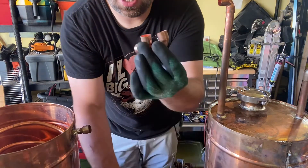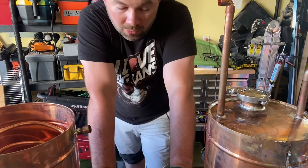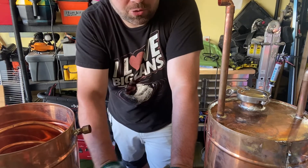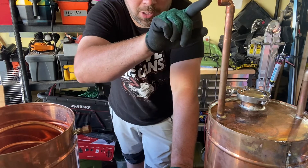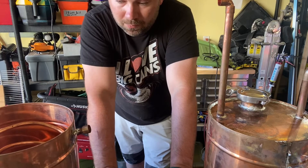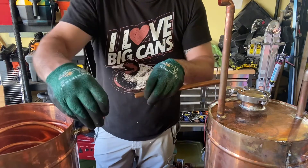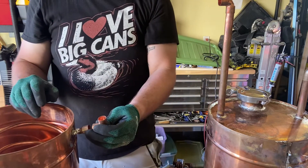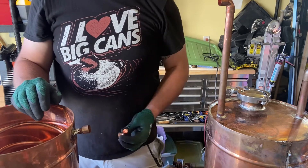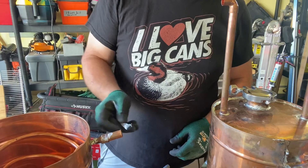For this portion you're going to need your two half-inch 90-degree elbows and the remaining piece of pipe. You might need a little extra than what's provided depending on how you want to set it up. For me, measuring from here to here is one foot, so we'll come in over, line up, and then down to the worm unit itself.